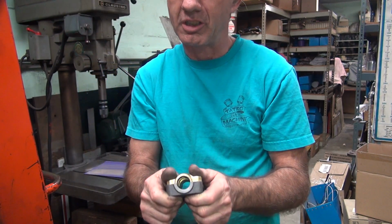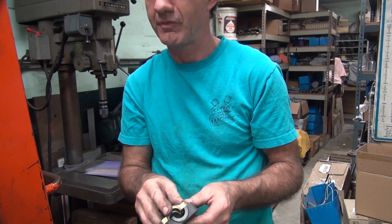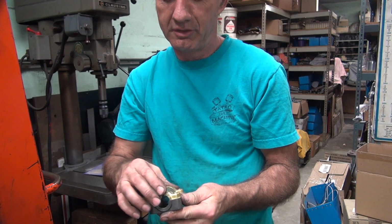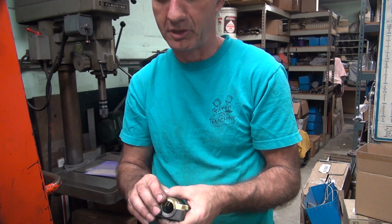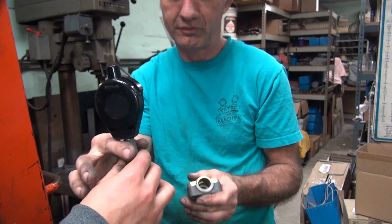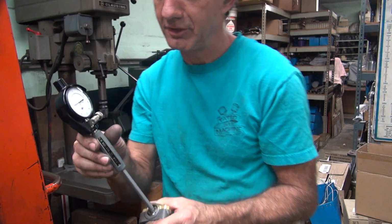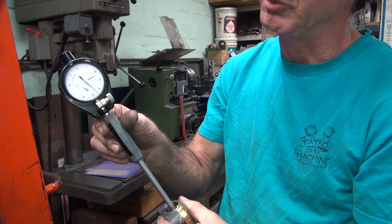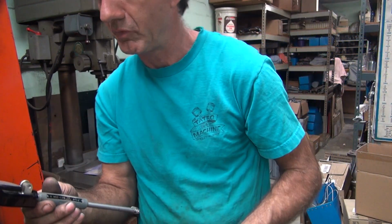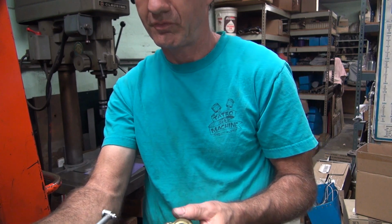Ooh. I mean, you cut 4 thou off that already? We're only supposed to cut 1. Now we gotta do a lot of honing. You sure you're negative, not positive? Here you go. Verify. Did I do it right? Trust but verify. What if I don't trust anybody? That's 4.5. It's even worse. You got carried away there.